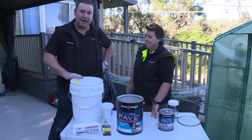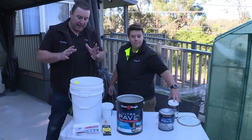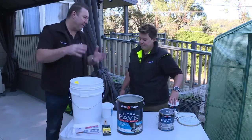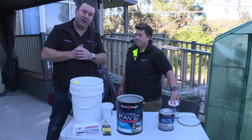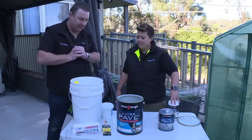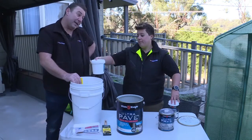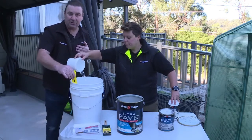Would you like me to explain why we need the thinner? With water-based paints it's even more essential than oil-based — water-based paint is touch dry in 30 minutes at normal temperature. If you were painting in the summer and your concrete was really warm, it could be dry in five minutes. Imagine how much time the paint's had to adhere — not much at all. So adding 20% to 25% to 30% water keeps the water-based paint wet longer so it can soak in and get a really good adhesion. That is the reason. Etching and thinning — everyone wins. So we've got about four litres of paint poured into our mixing bucket and about a litre of water — that's about 20%. Four litres of paint, one litre of water. Easy to buy litre buckets in the Bunnings stores to help you measure.